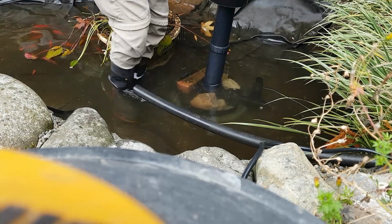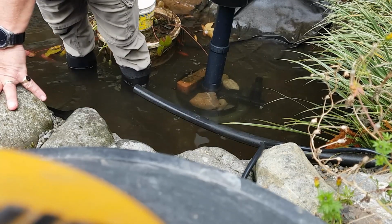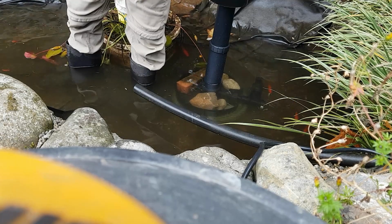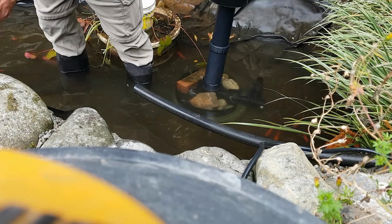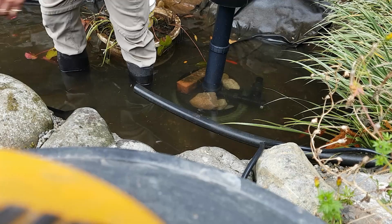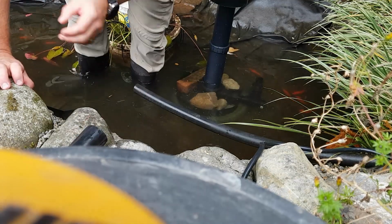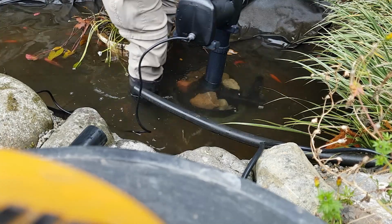Okay, now I've got to get the pump in. So I need 2-inch iron pipe steel to 1.5-inch ABS. So again, just a little bushing. It goes on the back, on the suction side of the pump. And I've got a little piece of 1.5-inch ABS that I scrounged from a plumber buddy of mine.